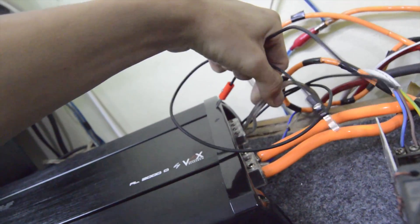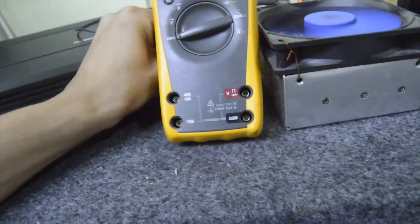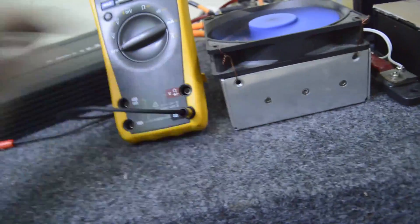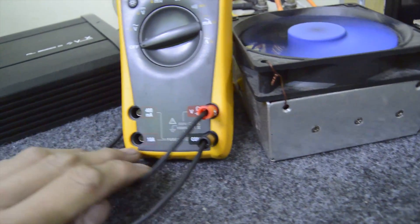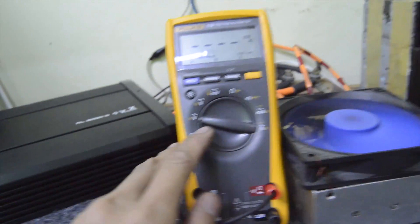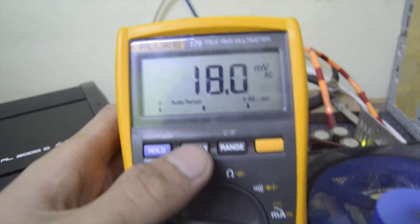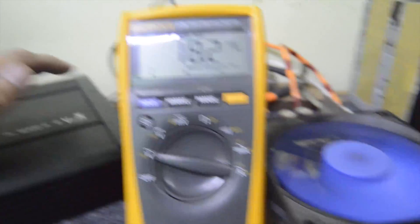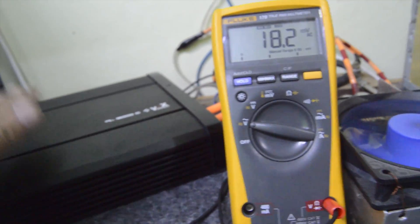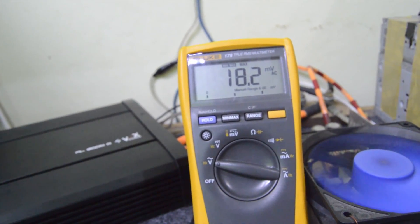We want to take our cable with banana plug — or simply test leads will also work. I might remove the music due to copyright, as it's annoying, but songs with loud bass are mostly copyrighted, so I'll have to remove the audio and make the video a time-lapse. We're going to connect it. If you don't have four terminals like my amp, you can just combine it with the two cables connected to the subwoofer. Take the multimeter, remove the original test leads, connect them to the ground and the volts. Set it to volts AC, and choose the min/max — set it to max.